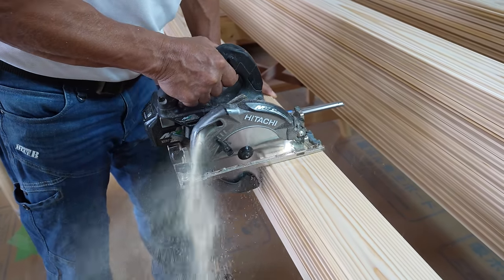The next room also uses planks for the ceiling, and this room's ceiling is horizontal. I'm using the same planks as in the first room, but their colors are dark — though it doesn't mean they are entirely dark. In order of darkness, I sort and install the planks within the entire room. In the first ceiling I installed planks in order of lightness, so it is the other way around this time. In the third room, I want to install planks with a mix of dark and light colors. If there were 30 bundles of planks for a house, I would sort all the planks by color, install the darkest and lightest planks on both edges, and make the middle room a mix — sorted to be a gradation.